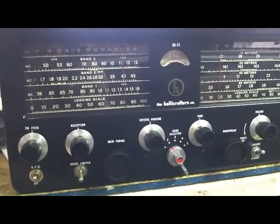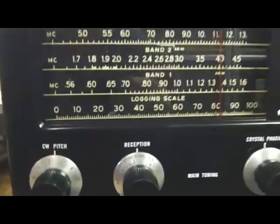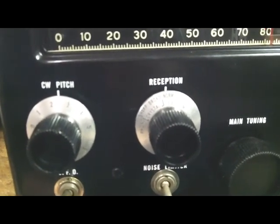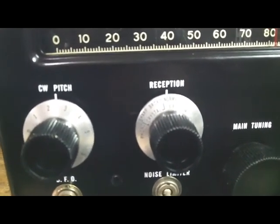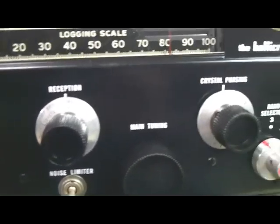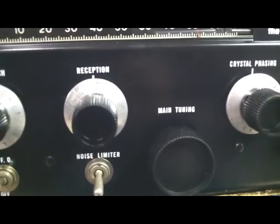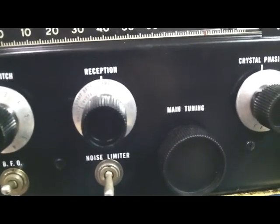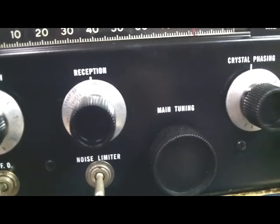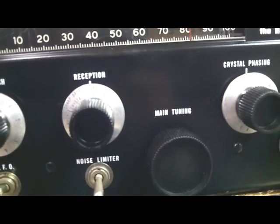Another little tip that I've learned: these knobs, I cleaned them as best I could, toothbrush, you know, did all that I normally do. Put them in my ultrasonic cleaner, cleaned them, and what I had been doing in the past is spraying a coat of satin clear on them. But one of the things I found is this plastic will absorb moisture, and if you don't wait long enough, if you spray that clear on them, it'll make that clear kind of fog up.